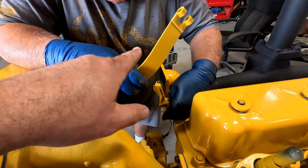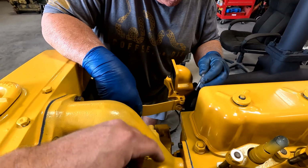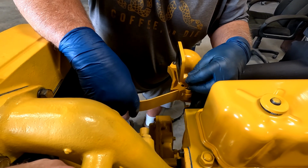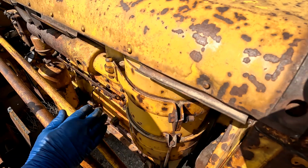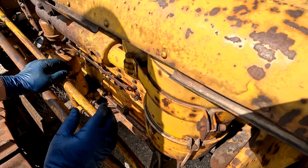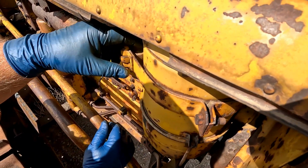And then there's that gasket. It was like a fiber, almost like a belt pulley belt that went around on the inside, but we're going to make something for it. The stuff, when we took it apart, it was pretty dilapidated. I'm going to go out here and look at Festus and see what it looks like. See, this one's got a little bit of it left up in here. Yeah, it's kind of a cloth. It's only about 1/16 of an inch thick. Yeah. See, here's a piece back here, too.